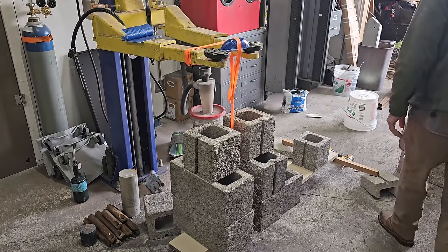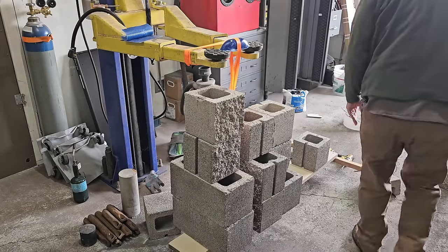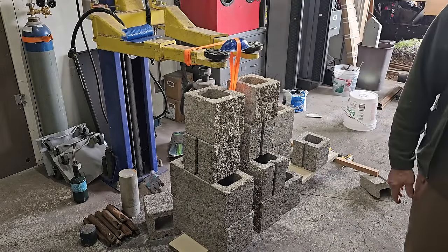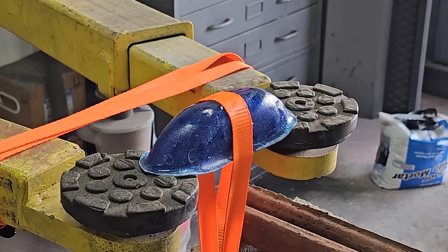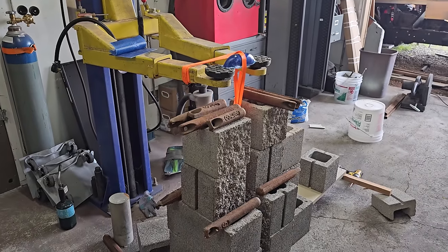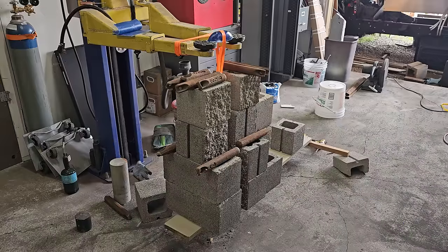I put them on a calibrated beam strap going down through it. Getting almost all my cinder blocks on there and the blister is starting to deform - caving in on the sides where the strap is putting pressure. I've run out of cinder blocks, so I throw on all the iron weights. The thing is really getting crushed down and smashed, but it's certainly taking the whole load. That whole load is calculated out at 289 pounds.